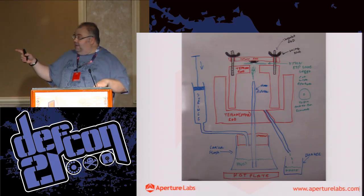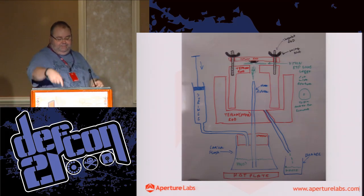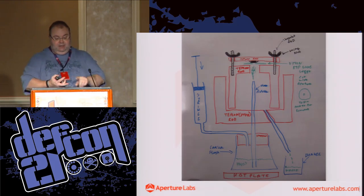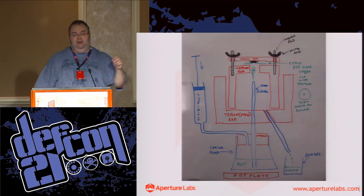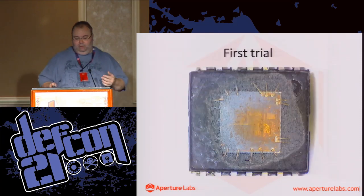When I eventually write this up after con, you'll see the pictures and you'll see that third probe penetrating the stopper. So my acid is at a known concentration. My temperature is at a known setting. My pressure is at a known setting. So my only two other variables at that point are the permeability of the epoxy to the acid and time. So it becomes pretty controllable.